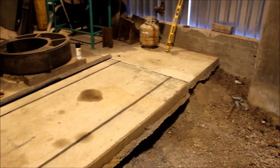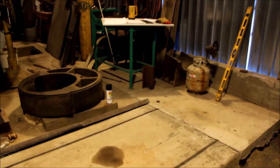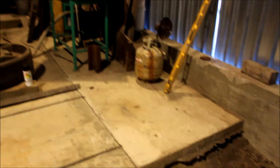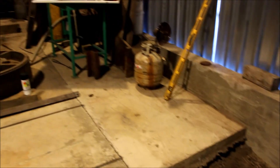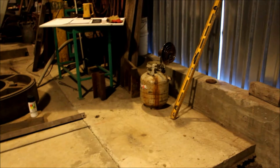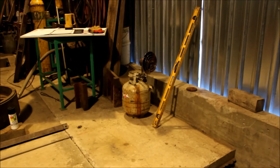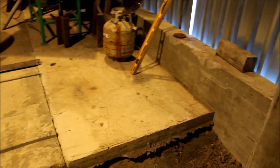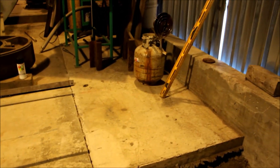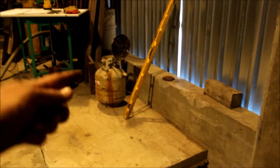I'm trying to work here with very shallow dimensions. Now in the back here, I haven't quite figured this out yet, but this little 4 inch slab that goes across - that was a temporary slab I put in a few years ago just so we could store stuff back here. That all gets pulled back out and will be dug down about 2 feet all the way back, and then we'll run dowel pins into the slab on the left and into that wall.